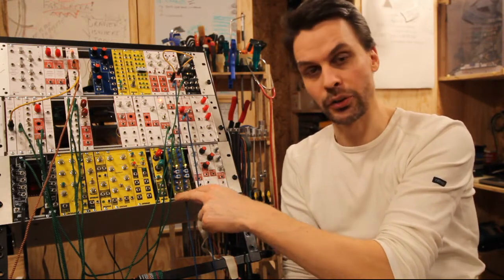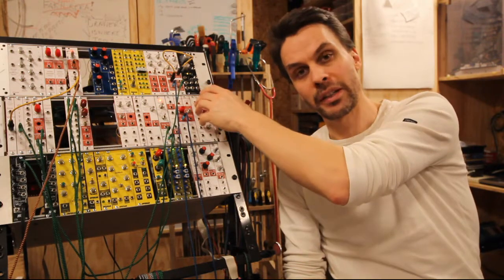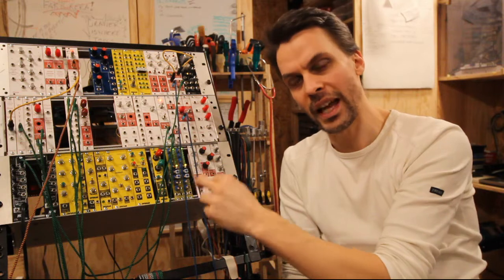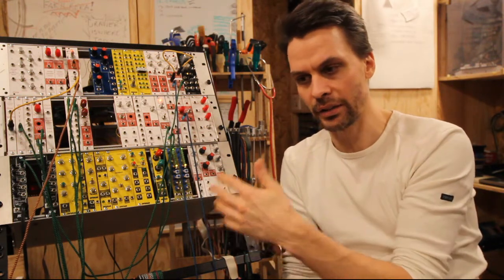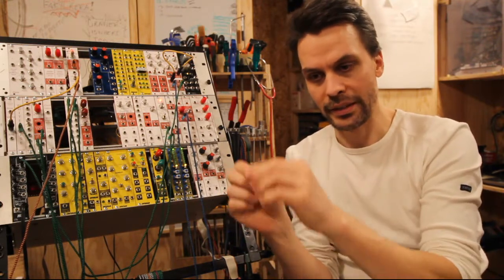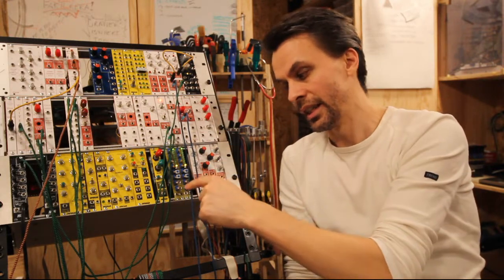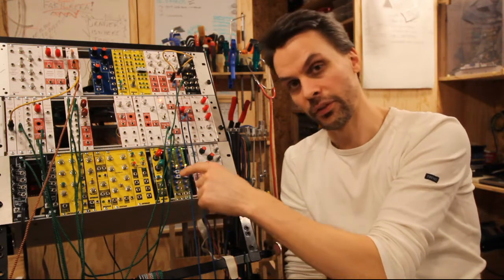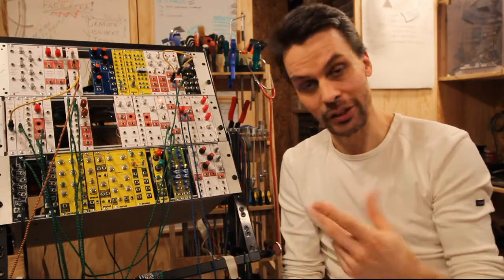And this is because you got two CV outs. What you could do is put them in a mixer and mix them together, but they always hold the last tone or note of each sequence, so that kind of messes up. Then you would have to mix the signal of the second sequencer so it adds up to the first sequence's last note, if you understand what I mean.